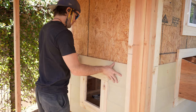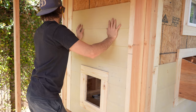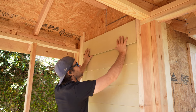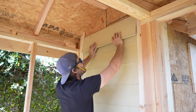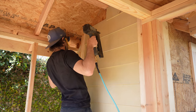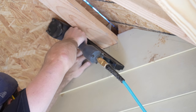After doing a few rows, I figured I should just do one side at a time, so I focused on this short side. Normally when installing siding, you should not use finished nails — it's supposed to be something with a larger head size. But the reason I used finished nails is because the framing on the inside of the coop will be mostly exposed. With normal nails through OSB siding, you can't really do much with the pointy end on the inside. But with finished nails, I can easily bend the inside portion to make it safe for the chickens. At the very top, I made sure to get the siding as close to the roof as possible, so there won't be any way for a predator to get into the coop portion.